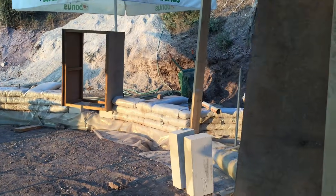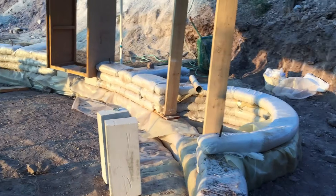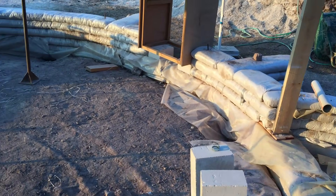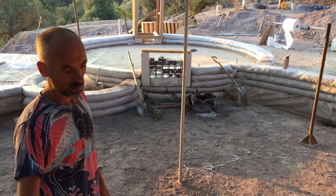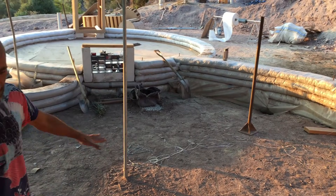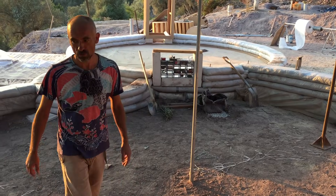We've got plastic covering our first couple of bags, and now over the top of that. The plastic on the inside we're not as worried about, because we're gonna plaster the walls and we don't really want to plaster over plastic on the inside. We're gonna bring up gravel here, put the earthen floor in, and that will have all plastic sealed underneath as well, so any moisture is not really going to be an issue here.